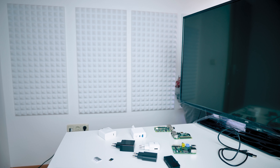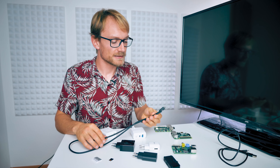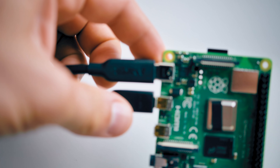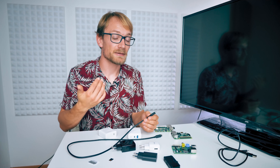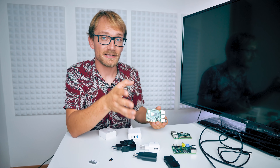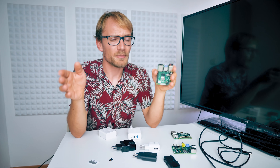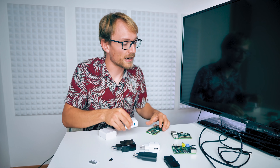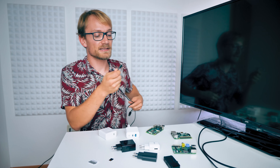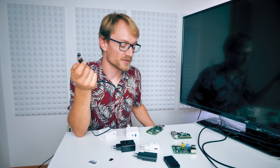Probably not to spec, probably causes some issues somewhere else, but for this it works. The other cable I tried was this USB 3 Anker cable, which is thicker and probably more to spec — and this one actually did not work. I plugged it into both power delivery supplies and the Raspberry Pi 4 did nothing at all. My thought is that the cheaper cable isn't made properly to spec, and because the Anker cable is made to spec, it is causing issues with the improper USB-C port implementation on the Raspberry Pi 4. But honestly, how many of you are actually going to power the Pi 4 off a USB-C supply? You're probably going to use a USB-A to USB-C cable, and those just all work.